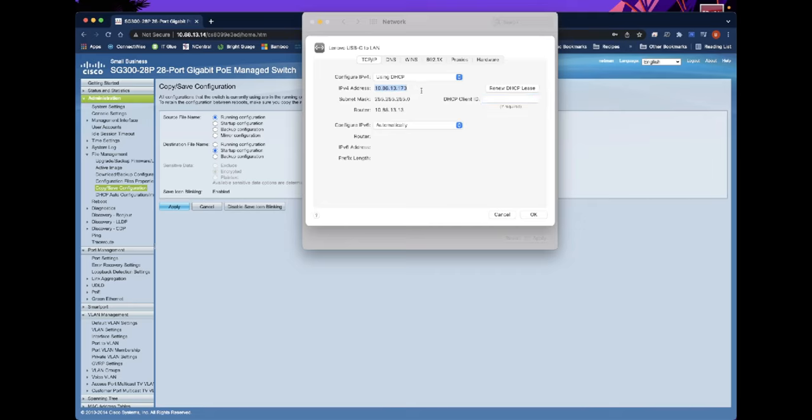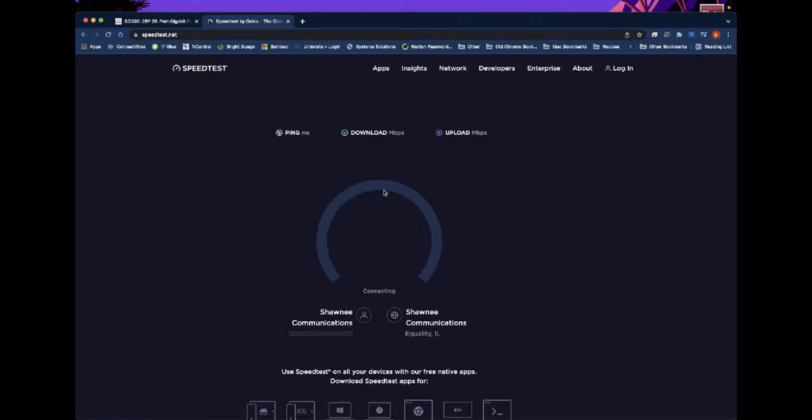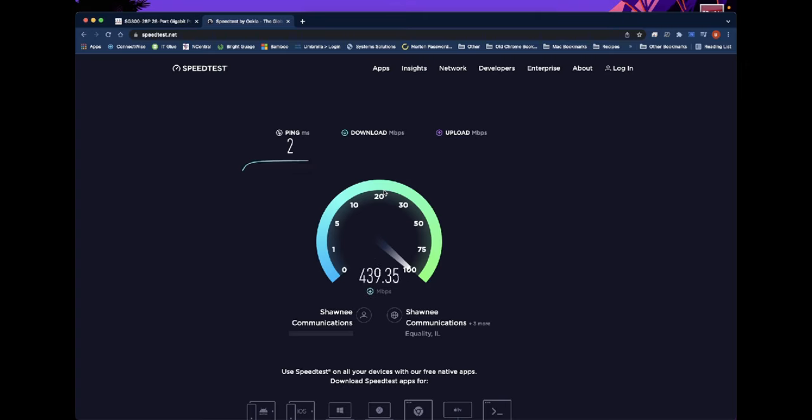The only test I'm going to do is a speed test. I can already see I've got an IP — I'll renew DHCP anyway and disable Wi-Fi so we can do the test properly. Using a speed test, we can see that we've got a good connection. My speed should be 500 down, 500 up, and we are pretty close to that — about what I'd expect. I'll call this cable run good. I could go around to each run and test each one individually, but I'm just going to test the two I'm using right now; if the others don't work when I use them, I'll look into it then.